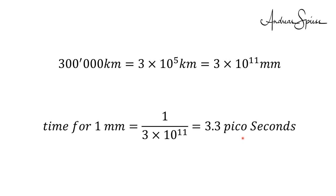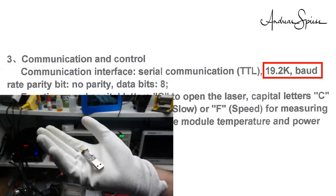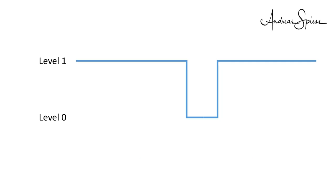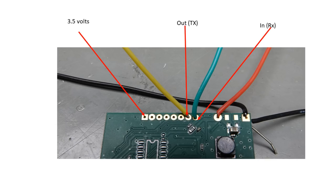First we have to connect the module and make it work. The datasheet says that it uses 19.2K baud signals, and the supplier sent a USB to serial converter together with the device. But its supply voltage is only specified between 2.5 and 2.8 volts. So, which voltage levels are appropriate for the logic chips? To find this out, I will power the device with the proper voltage and measure the voltage at the TX pin using an oscilloscope. In the standard configuration, TX is at logic level 1 if nothing is sent. During a signal, this is logic level 0, and really the pin is at 3.3 volts. A close look at the PCB shows a boost converter with a coil, which boosts the input voltage to around 3.5 volts. So, we should be secure using our USB to serial converter switched to 3.3 volts.